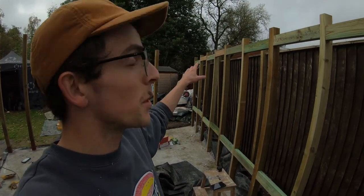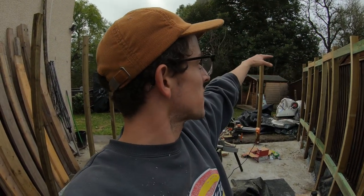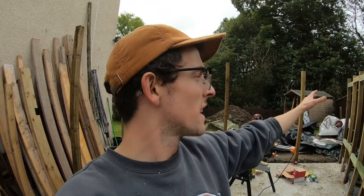So I've sort of worked my way along the back wall putting dwangs in — 60cm from the bottom and between 15 and 20cm from the top. They kind of chop and change a little bit just for the sake of getting the screws in, but when I board this out you won't see any of that and it's all within tolerance for a sheet of ply to be screwed on. I think it's fairly standard practice to put dwangs in at offsets so you can get screws in at different angles — it saves having to put them in at 45 degrees from a corner. Anyway it's a bit of a time-consuming job and not very interesting, so I'm just going to go around and put in these dwangs and check back in when I've put in the majority of them.